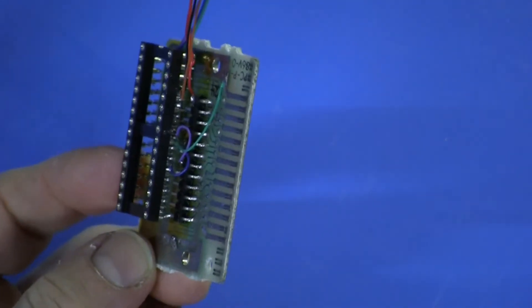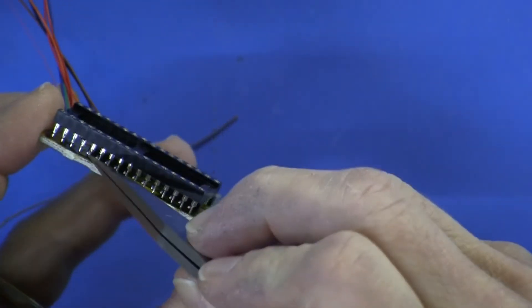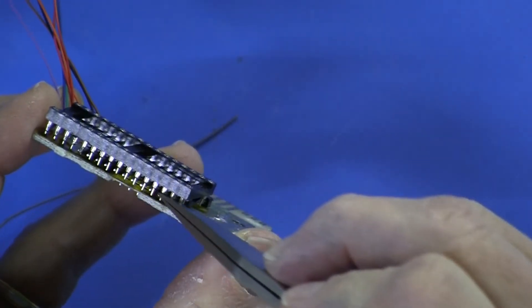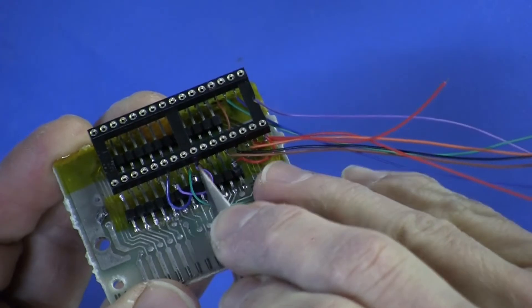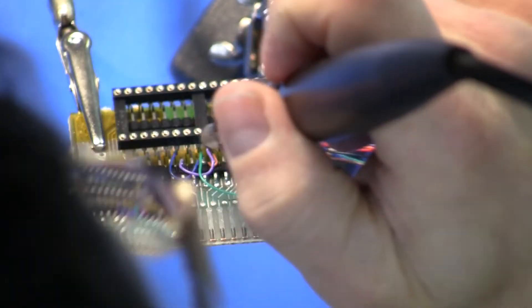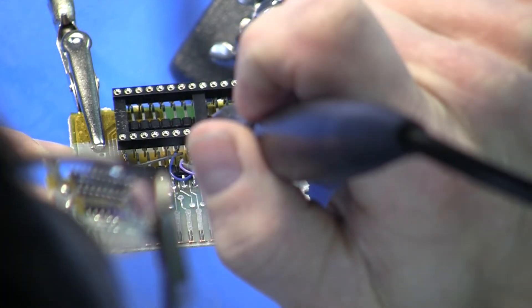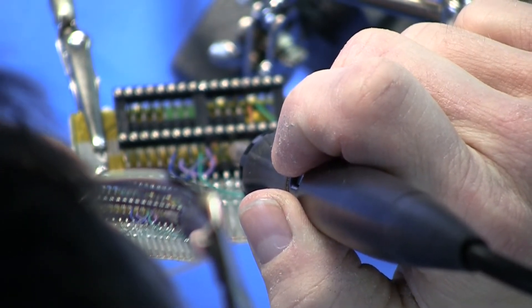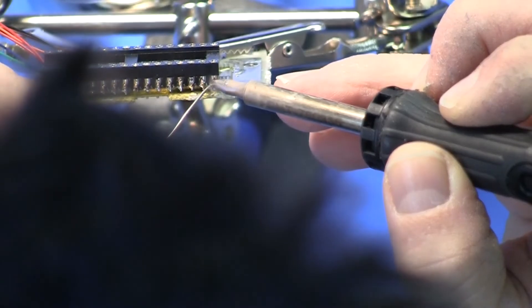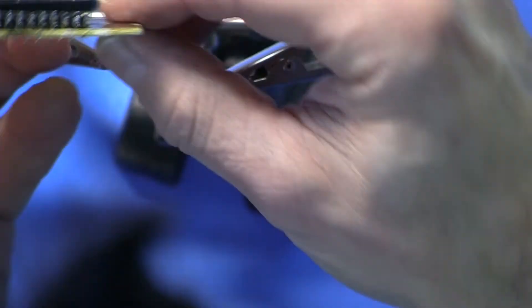There's a corner pin holding here and a corner pin there. The remaining connections are very easy to make. There are a couple of tighter ones — if you're feeling shaky, come back to those in a moment. And I think the soldering is finished. Now I just have to make the eight connections to the DIP switch and the pull-up resistors.